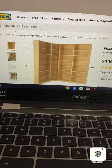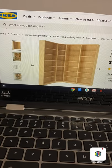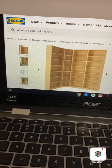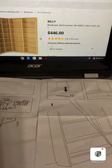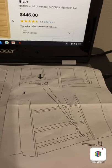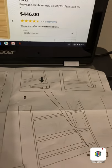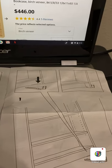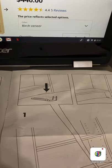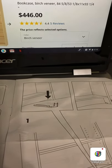I bought one small and two of the larger units, and seeing how well everything fit together in the pictures and at the store, it made me believe that this was an easy thing to do. As most of you know, IKEA does not come with any written instructions. Looking at this particular page, I didn't realize that each of the bottom braces comes with a notch and you're supposed to fit that notch on the bookcase exactly where that arrow is pointing — so that was my first mistake.